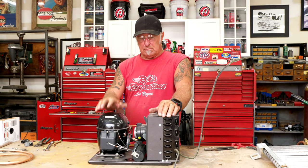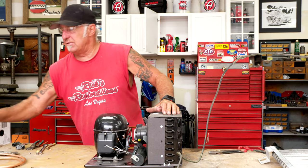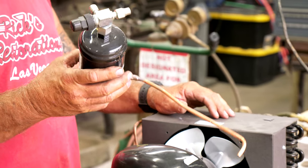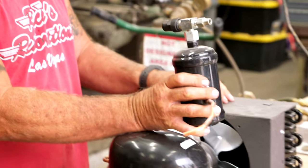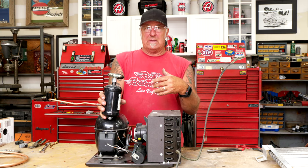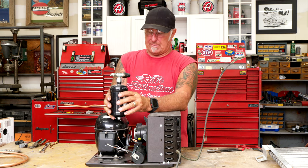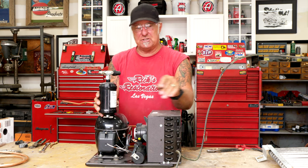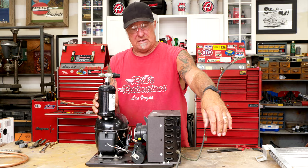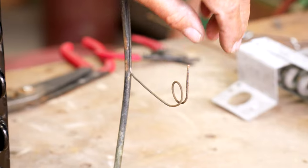What I've done here is this is a compressor deck that you can buy. It has a receiver on it, which is for a different kind of engineering on the machine. To keep it simple, you don't actually need the receiver because you have a little line called a cap tube — a capillary tube. Engineering-wise, this comes in three or four different sizes.